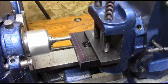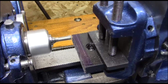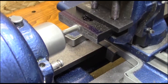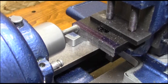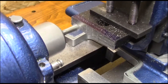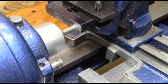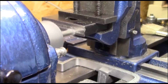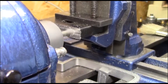There was quite a bit of material to take off, so I bandsawed it off. Now I'm just taking it to the scribe lines to make it the right width overall. This takes quite a few passes because the milling attachment can't take off big chunks — usually between 5 and 10 thousandths per pass. It may not look like it, but those passes, once you get done, are very, very smooth, even though you can see the tool lines on the film.